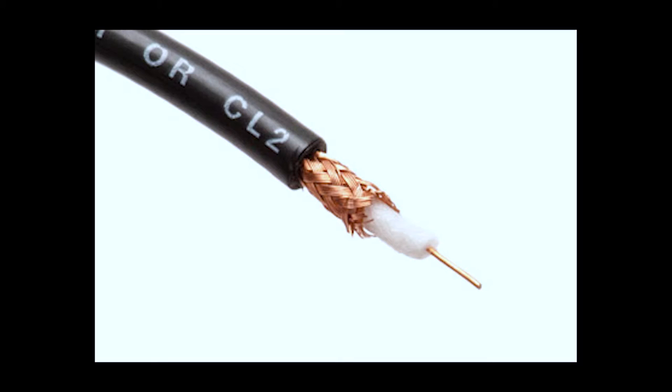Like its bigger brother, the miniature coaxial cable has a center core, middle conductor, and an outside plastic vinyl jacket. But unlike its bigger brother, though, this type of cable uses a single strand of wire in the center. It's very expensive and is also very fragile. Only small 10-32 thread type accelerometers use this type of cable and are usually only recommended in special aircraft applications.